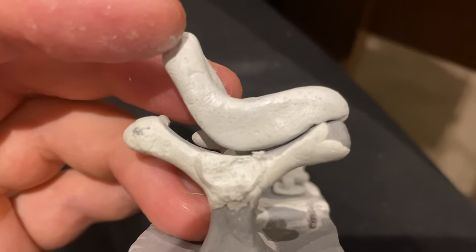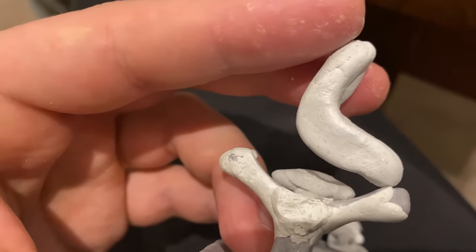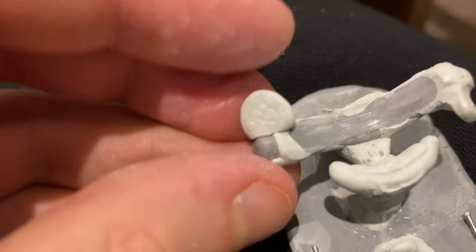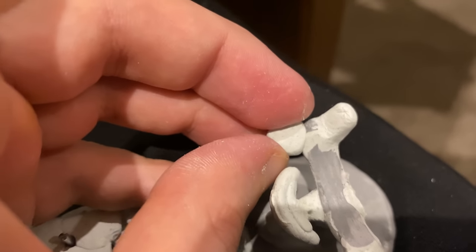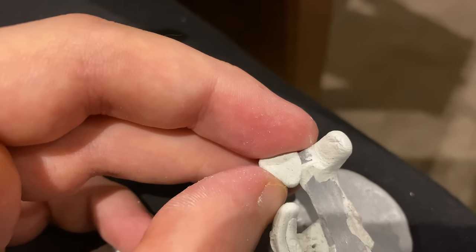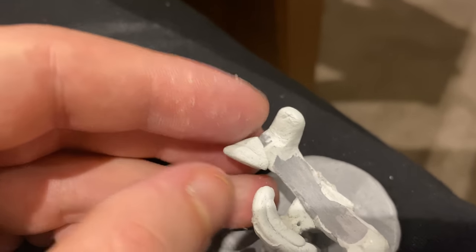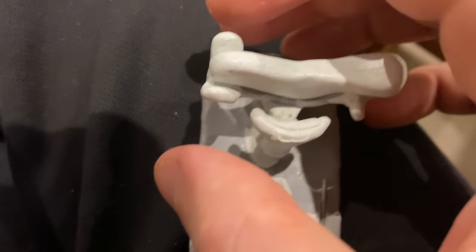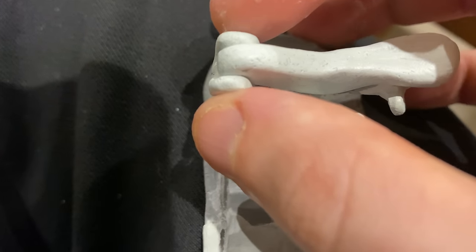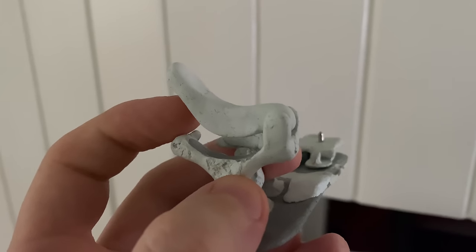I made a soft mock-up and I think we're going from that bottom corner — that should be enough pull. Okay, we're going to make the barrels of the hinges here. Put one side here and we'll do the same on the other side. We're going to stick another one here, keep them splayed for the moment, then fold them around the initial shape. The important thing is that this is just a secure bond so it doesn't crack. We fold these around — this is going to stick since it's all uncured putty, but we wait till it's semi-cured then crack it out and shape it afterwards with the Dremel. It's the next morning — perfect.